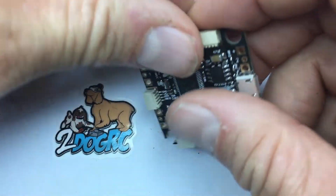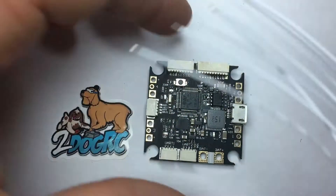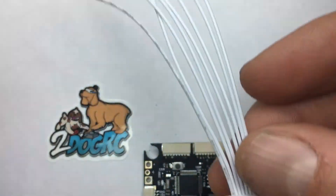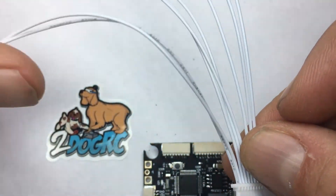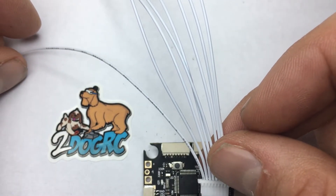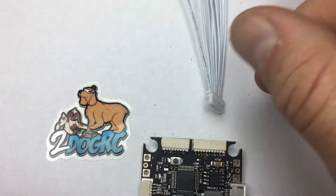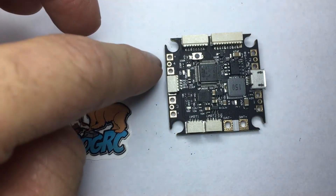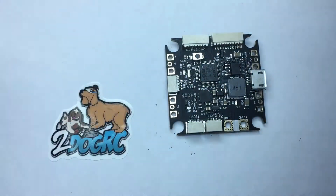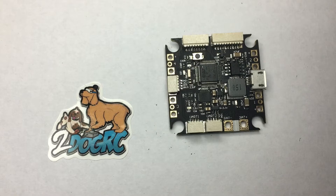Then you've got this harness where all your good stuff gets plugged into. For the ESCs, take each signal wire, desolder the signal wire off your ESC, and just solder this directly to your ESC. Then if you need to change out your flight control board, pop it and you're done. You also remember that your ESCs can plug right in here as well, so you've got two different ways to hook up your speed controllers. That's the beauty and uniqueness of this board.